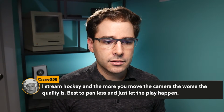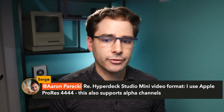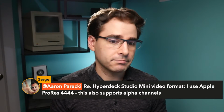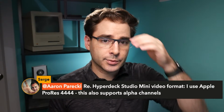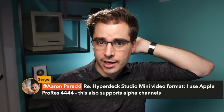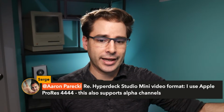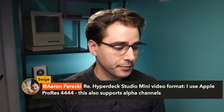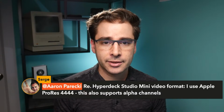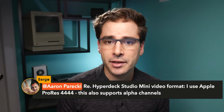All right. Serge says, Hyperdeck Studio Mini video format, Apple ProRes 4444. This also supports alpha channels. Yeah, if you have an alpha channel to export, that's cool. You'll need to run your dual SDI outs converted to HDMI into the ATEM to bring them back in, but that does work. It's not really meant to be used with the ATEM because there's only 4 inputs and you're going to eat 2 of them for your graphics, which is a little bit silly.